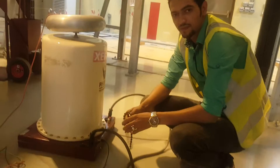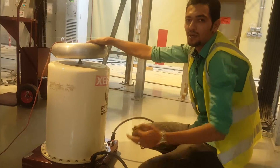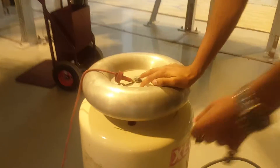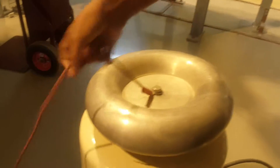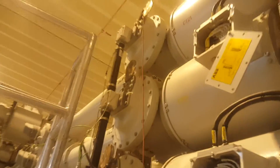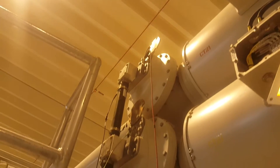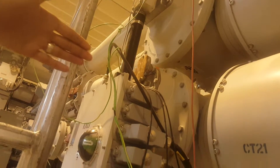For our primary side we have a connection from V10 and we are injecting from here, through this one, through the air switch. We are injecting one phase at a time. On the upside we are connecting to the red phase, but the other two phases should be grounded — we are making the yellow phase and blue phase grounding.